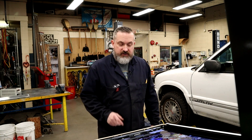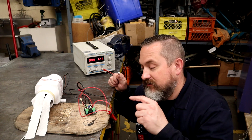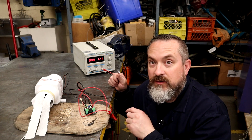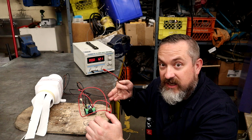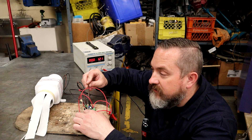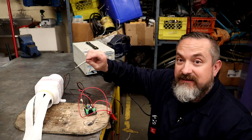I'm going to leave the shaker controlled by pulse width modulation through Arnaud's boards, which means the CST shaker board is not being used for the shaker. However, keep in mind this is not just a shaker motor board — it's a motor controller board. Any motor can be pulse-width-modulated with that little screw pot. I want to put a blower fan in, and if it's too loud I've already got this board set up, wired to a 12-volt supply. Turning the potentiometer clockwise spins the fan up, and you can go all the way up or dial it back down.